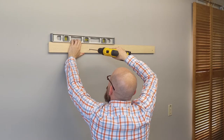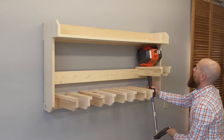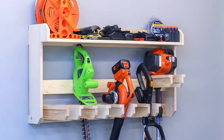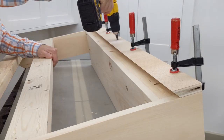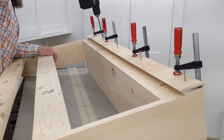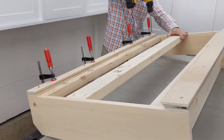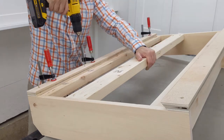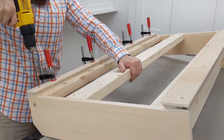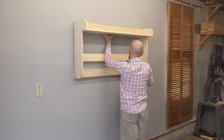Let's install the cleat on the wall. I made the French cleat so I could hang this yard tool rack in my garage — I'll leave a link to the free plans for the yard tool rack in the description box below. On the back of the rack I placed one of the cleats with the wider side facing out and the bevel facing towards the bottom of the rack. I attached a piece of wood the same thickness as the cleat on the bottom of the rack. This piece makes the rack stand straight up and down on the wall. I positioned the rack where I wanted it in my garage and made a mark at the top of the rack.